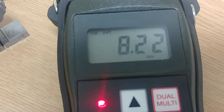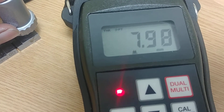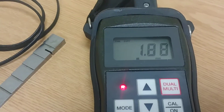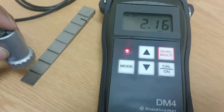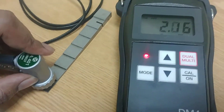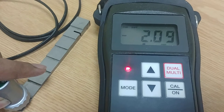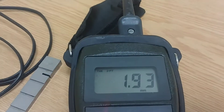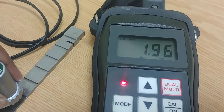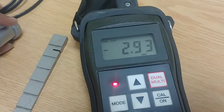The machine is now calibrated. On the top side it will say two-point calibration along with the thickness. I can now measure any thickness. This one is 2 mm — confirmed. For very small thicknesses like 1 mm, placing the probe gives a wrong reading — about 2 mm — because of a problem called doubling; it takes the second echo or fourth reflection echo. We try to avoid that. The third step reads 3 mm — the machine is calibrated correctly using two-point calibration.